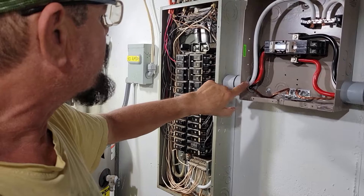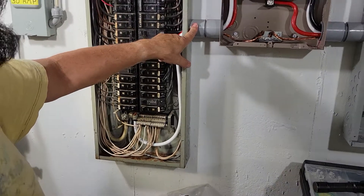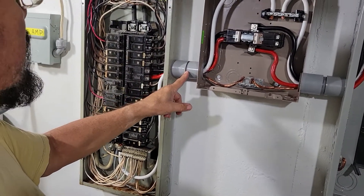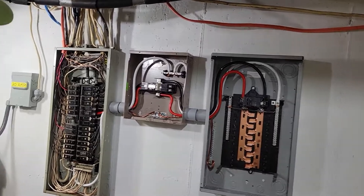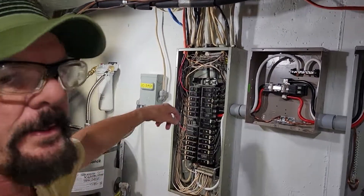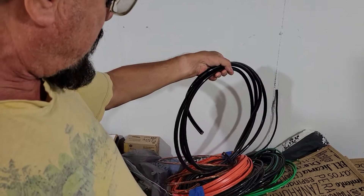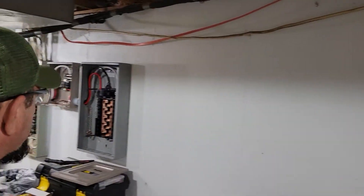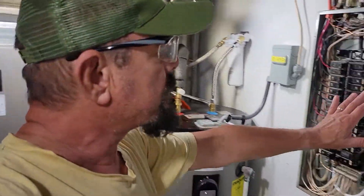I had to put the box ends in, and I put waterproof fittings along with the PVC cement. Had to whittle down everything to make it all fit right, but I'm glad I got four inches in between — the thing looks really uniform. I like that. To that end, I had bought 27 feet of one-inch conduit because I had envisioned taking runs in and out, and I used about — I don't even think I used half of it. I've got a bunch of one-inch left over that I'll probably never use.